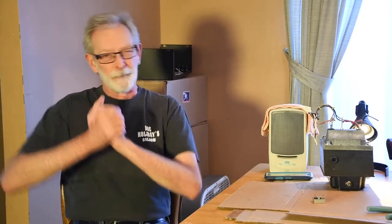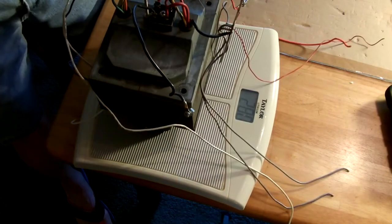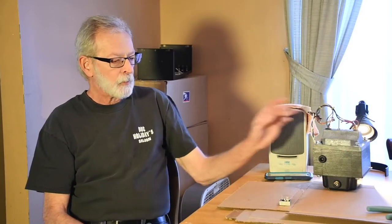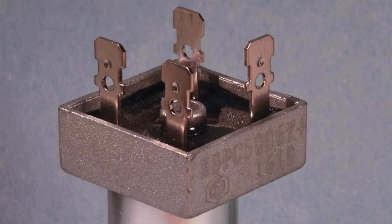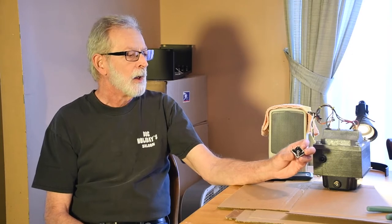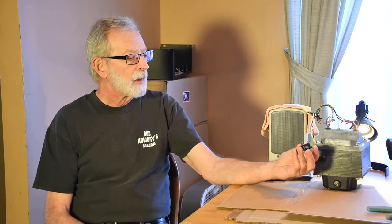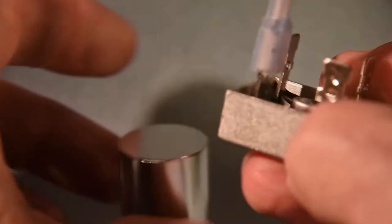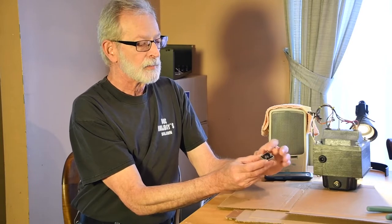Today's episode is fun with bridge rectifiers. Here we go — a little bridge rectifier and a big massive 28-pound power transformer from a Phase Linear Model 700. A few modifications had to be done to this rectifier. The manufacturer doesn't automatically assume somebody is going to hang too many things off of their rectifier legs. Little blue clip-on things unfortunately won't work here. There is AC in on these diagonals, DC out on these diagonals.